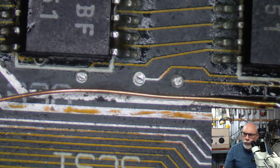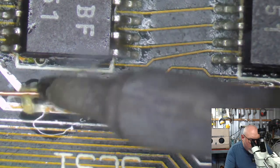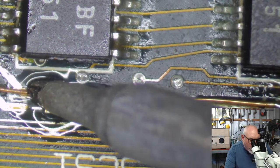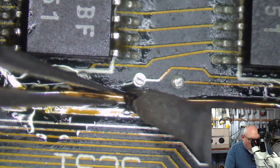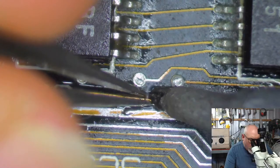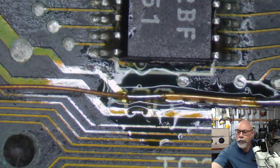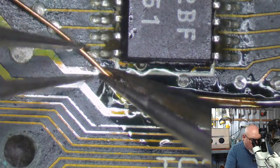SD card with several images to boot for my version 5.5. Several images. It's quite tricky with a SCSI2SD to do several images. The version 5.5 will allow you to have four different SCSI IDs. But there is no way to select which SCSI ID you want it to boot from. It's not like the modern Macs where you can just hold down the option key and see all the different drives that come up and then select which one you want. They don't work like that on the Mac. You have to boot from one, and then once you're in there, set your startup disk. But it's not like the modern Macs that have a startup screen where you can select what you want to boot from. So, you can create multiple partitions and put different systems on each one.